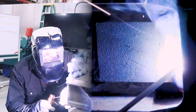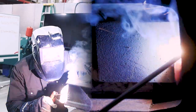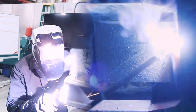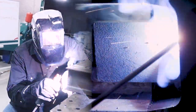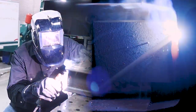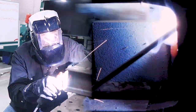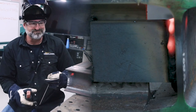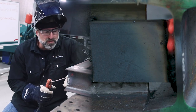When welding SMAW in a vertical position, you need your rod angled slightly downward, pushing the rod into the metal as you weld, touching both sides, making sure the puddle is tying into both pieces you're joining — that will leave you with a nice, slick weld profile. Welding SMAW in horizontal versus vertical-up are two different techniques: horizontal is more of a dragging technique, while vertical-up is more about pushing.